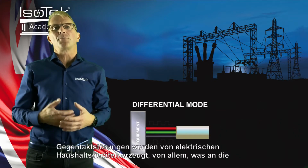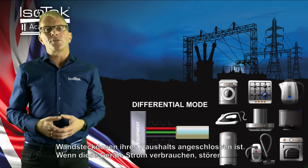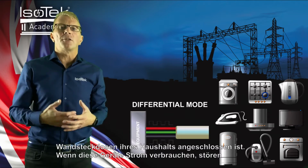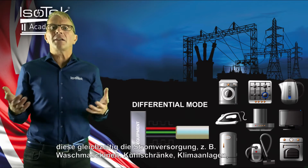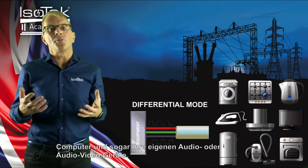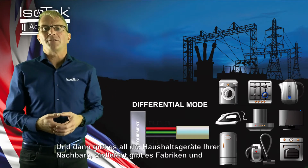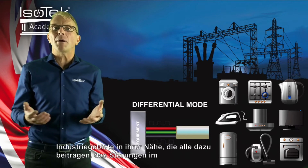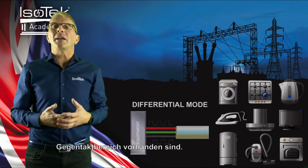Differential mode noise is produced by electrical household appliances, anything connected into the wall socket around your home. As these devices draw power, so they corrupt the mains power. For example, a washing machine, fridge, air conditioning systems, computers, even your own audio or audio video items. And then there's all your neighbors' household appliances. Maybe there are factories and industrial estate nearby. These all contribute to produce differential mode mains noise.